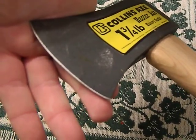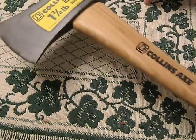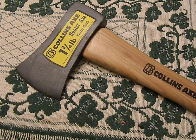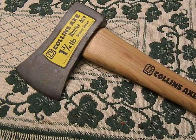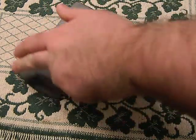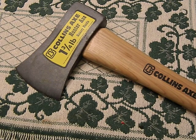Strike two is the edge. It's basically sharpened like a pocket knife — just a little tiny flat ground edge bevel, which is really no good when it comes to cutting. It's okay for shaving down wood, but if you want to use it for taking down limbs and small trees, it's not going to do it. That edge being a point like that is just going to hang up in the wood and not cut well at all. To make this serviceable you'll definitely have to reprofile the edge and give it a convex edge. That's strike two.